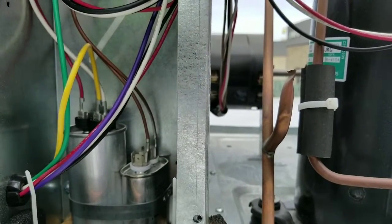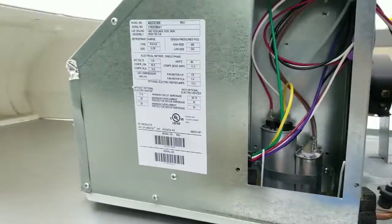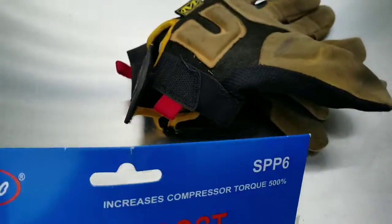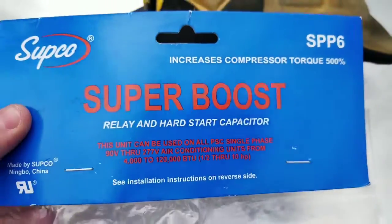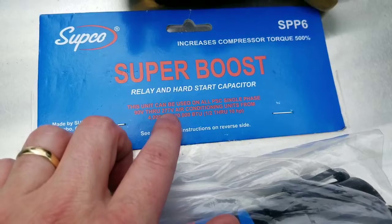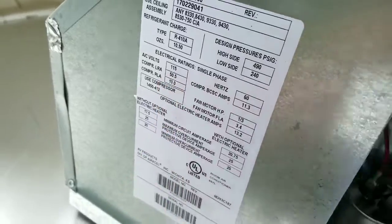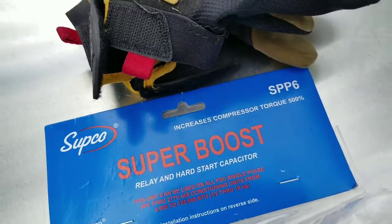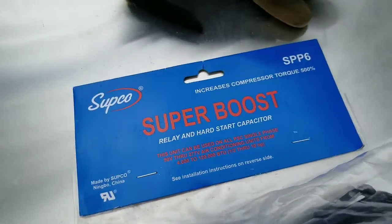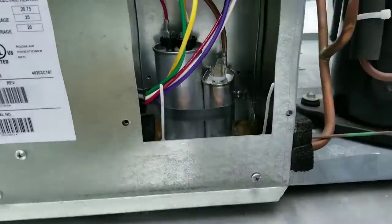You can see that we have — okay, so I had to stop and check my capacitor. I had to make sure that I got the SPP6, not the SPP6E which I originally had, because the SPP6 is 90 volts through 277 volts. Here, if I look, I got 115 volts. So I couldn't use the SPP6E because it was only 170 volts to 277 volts. The SPP6 has a wider voltage range. So we'll go ahead and install that.